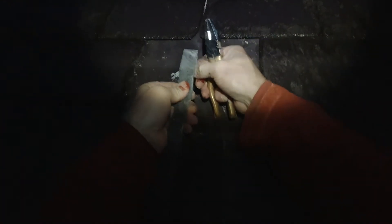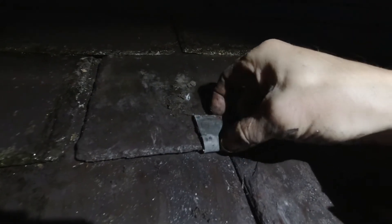I cut my finger. Okay, so now it's hooked properly — I can't pull this out anymore. Now I'm going to push this up. So that folds over like that. As long as this tab holds — the weight of the slate when it gets really really hot will cause that lead to come up and eventually the slate falls off in the garden or courtyard again.